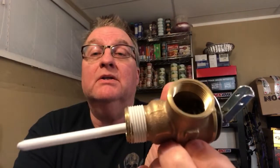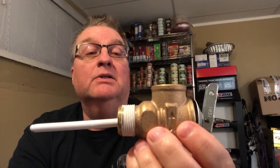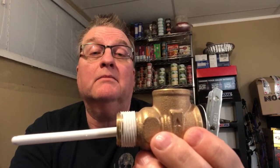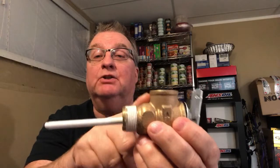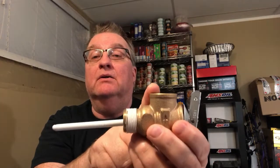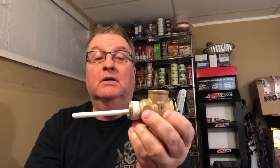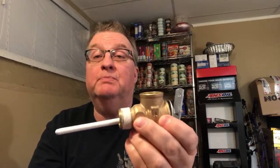You've all seen this hanging out of your trailer — this is usually pretty much all you can see of it, back by your hot water tank. Your relief valve is your manual test valve. Some people think you should test them, some don't. Being a power engineer, I have mixed emotions because we do not arbitrarily lift PRVs just for something to do. At the same time, on something like this in a trailer — you're sleeping in it — should this malfunction and not release, you're going to have a catastrophe. The amount of energy stored in that small hot water tank in your trailer, believe it or not, is enough to probably blow a 30-year-old trailer to pieces. Huge, huge power there. They drove that through our brains like crazy in power engineering.